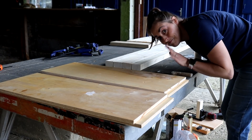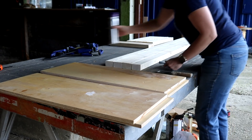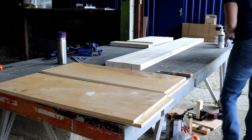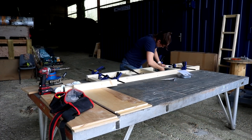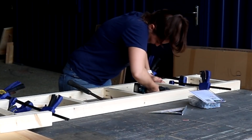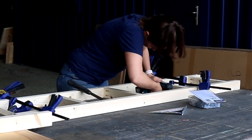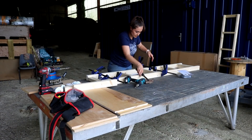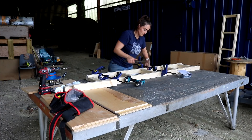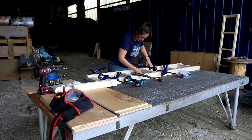Fast forwarding to the Love Your Weekend TV barn set — I've got all of my cuts laid out in front of me. Unintentionally I forgot to film the first half of screwing the frame together. But what I did was line up all of the strips to my pencil marks, glued and clamped them together. I'm using a speed square as I go to make sure everything's square, and with the table not being the flattest I had to use a hammer to tap the strips to make sure nothing was proud.